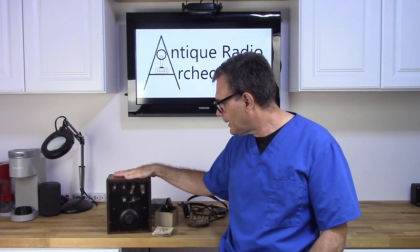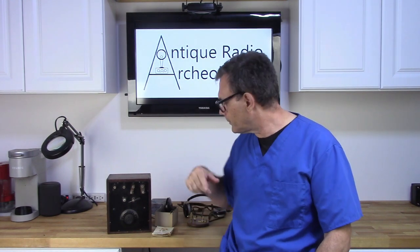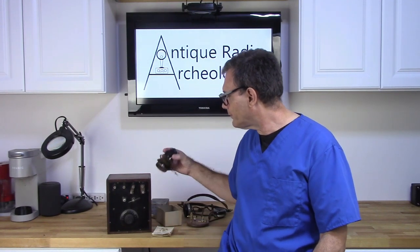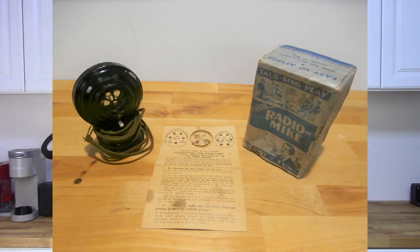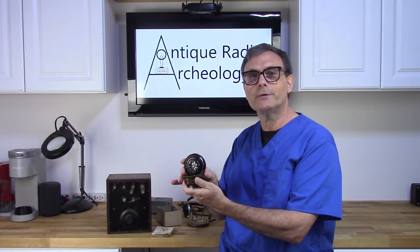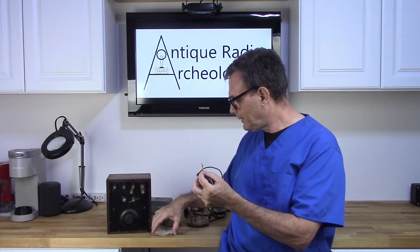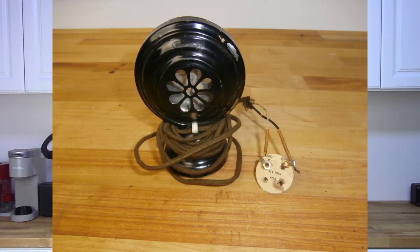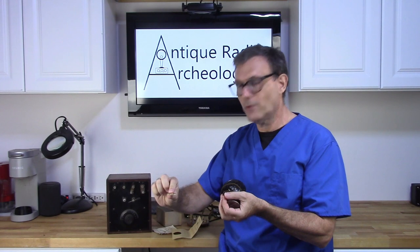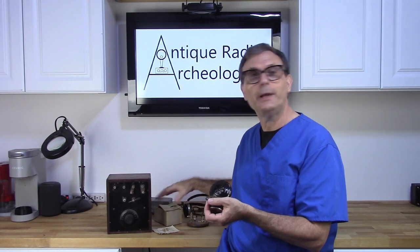if it works. The other thing that happened while I was doing the videos on the other things is I had pulled out this little microphone. Now this is a little radio mic, Talk-Scene-Play. It's kind of a novelty little thing that came out in the 30s. All it is, is a microphone that you tie to a little disc that you cut out of the instruction sheet, and you add these little metal tabs to it. So you attach the mic to the tabs, and you put this over a tube socket, and then plug the tube in. And it allows you to talk over the radio.